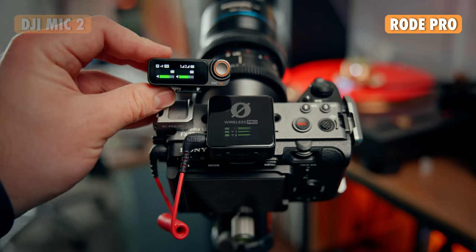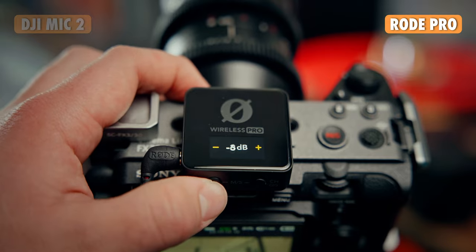When you record audio with these systems connected to the camera or internally, there is a chance the internal clock may have a delay — meaning after recording for a significant amount of time, each mic could get a bit out of sync. That happened when I was recording my DJI Mic 2 review: my internal recordings got out of sync from the camera recording by maybe four or five frames. I've never had that happen with the Rode system — when connected to the camera it is basically dead on. The internal clock on the Rode is really, really good. I'd recommend checking out Potato Jet's video where he ran them for several hours to see the differences. The Rode system, when connected to the camera, was dead on, and when not connected was off by maybe two or three frames after a couple of hours.